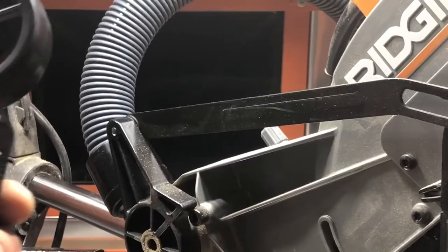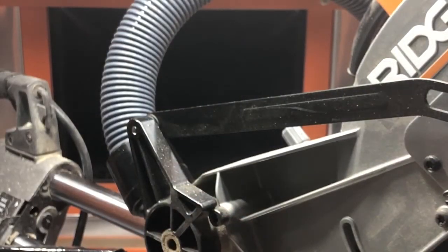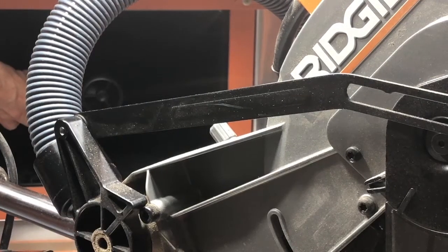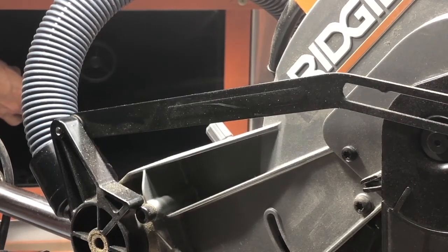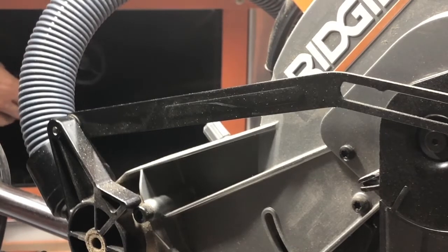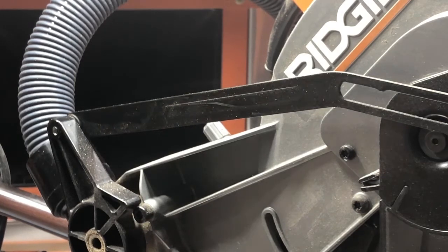For the sake of time, just come back and look at it. You can see that it's moving around — it didn't give me a really good reading so I'm going to go ahead and do it in the middle. That showed an average of about 500 to 600 CFM. If we did it right at the hose we get a much higher reading, but since it opens up like this it's down to that 500. When I tested it right at the hose I was at about 1400.